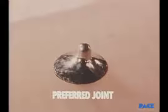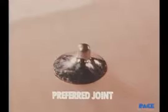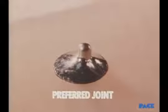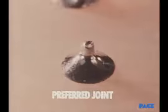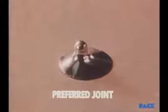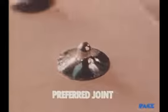First, there's a correct amount of solder and good wetting action. The surface is smooth and well feathered out to the edge. There are no pits or holes in it, and no evidence of flux once the joint is cleaned after soldering. The appearance of the surface is bright and shiny.